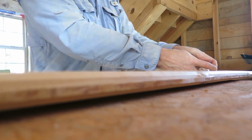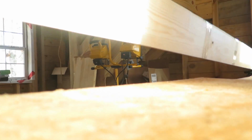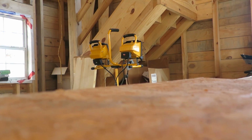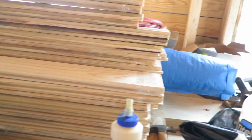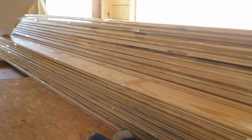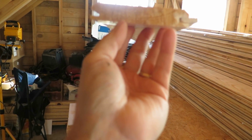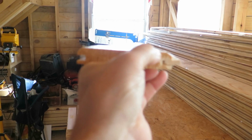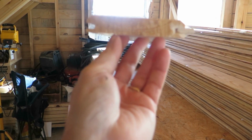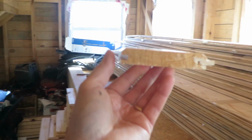Make sure the tongue is in its place. Like I said, once you get going, it goes pretty quickly. So yeah, there is a completed piece. And the only other thing I might do, I haven't decided, but I may run these through the table saw later and put little 1/16 of an inch kerfs, 2 or 3 in it, to keep the piece from cupping. It cuts the back grain here. If you did it in 3 spots, it cuts the back grain and keeps the thing flat.